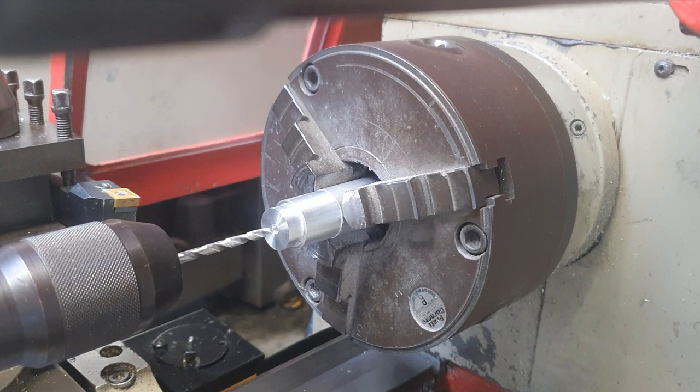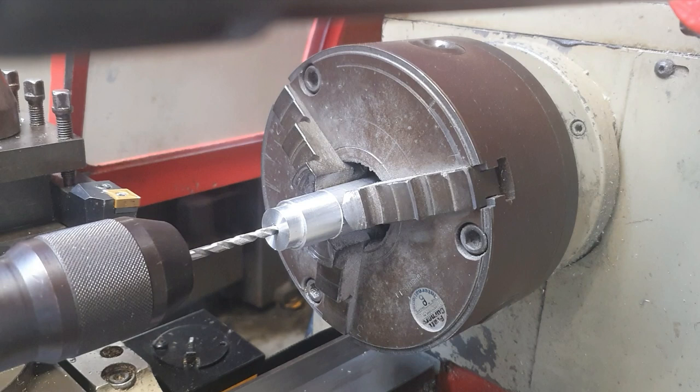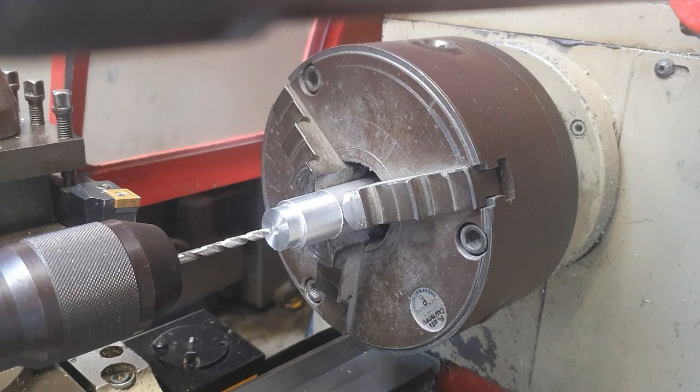As you've seen there, I switched from my center drill to my normal drill bit to drill the hole. I was going back and forth at regular intervals — drilling a little bit then bringing it back out. That's very important to allow the drill flutes to get cleared out as the hole is drilled, especially as we get deeper. You can tell the drill bit is struggling if you hear a screeching noise or if you're having to force it.